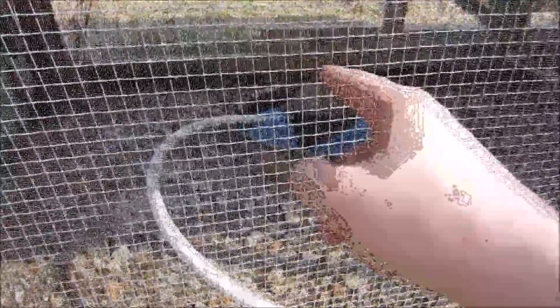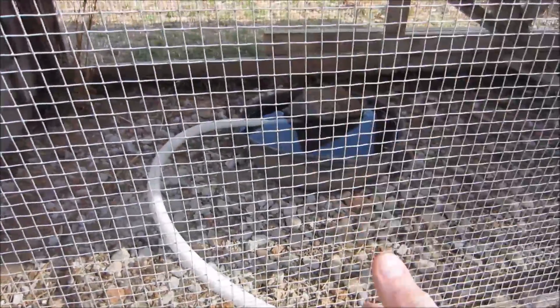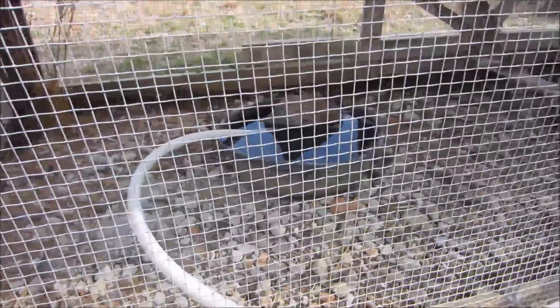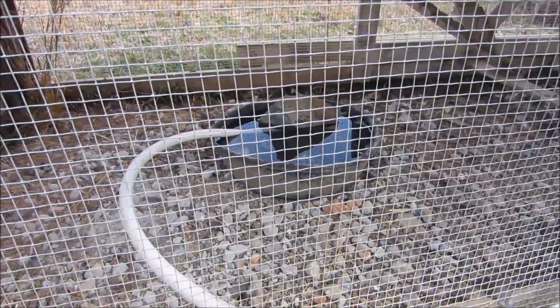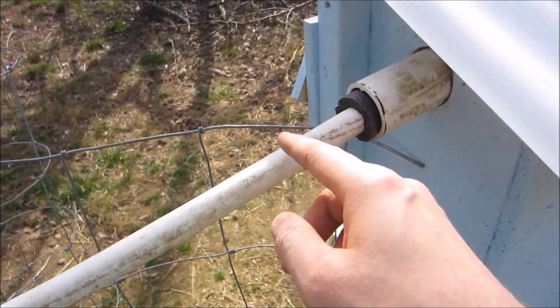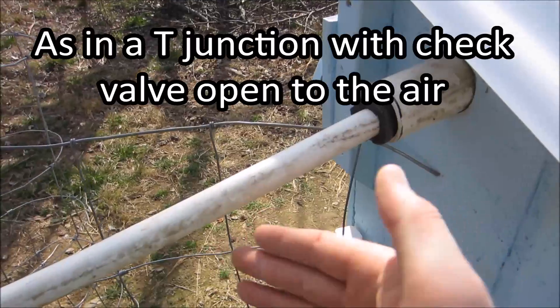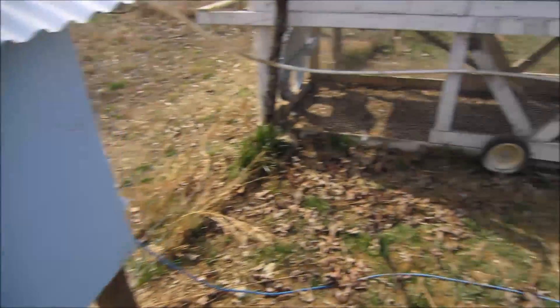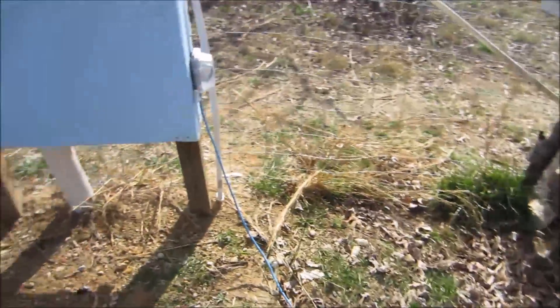I realized this line is going to hold water because no air can get to it. I could put the line slightly above the water and have it spray in at a diagonal — that would kind of fix it. But what I'm hoping is that gravity will cause it all to empty and refill the line with air. That's not going to happen, so I think I'll end up purchasing a couple of check valves and sticking them up here so that once the water stops flowing, air can get in and drain the line — sort of an anti-freezing mechanism like you see on exterior spigots.